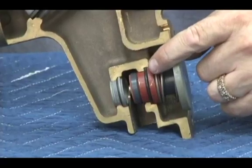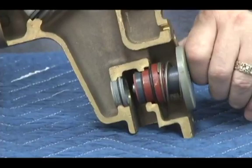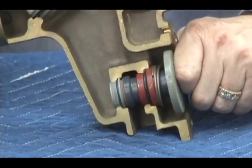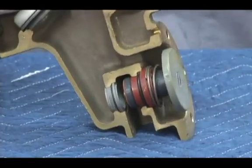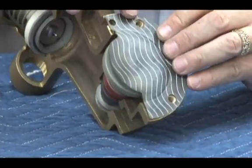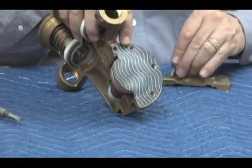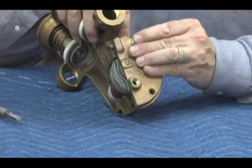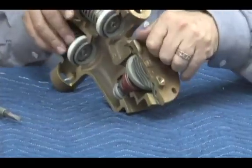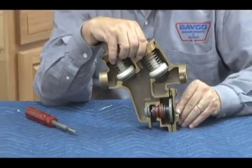Also, that's what sets my mounting O-ring right there. In other words, by here, it's not set, but as soon as I push the stem in place and stroke it once, you'll see that the O-ring falls into its slot. So now I'm ready to go ahead and line up my relief valve sensing line with my elastic element, my diaphragm. Go ahead and put my cover on, like this. And I'm done, right? Well, maybe.